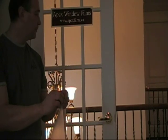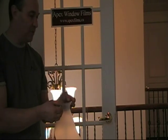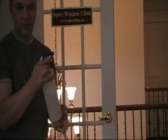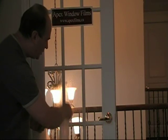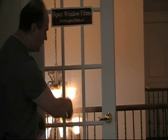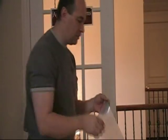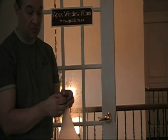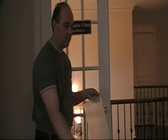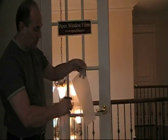In a previous video we showed you how to clean the window, so I hope you already watched that — it's a kind of an important issue. Once the window's clean, we've got our soapy water solution. You're going to give it a light spray. Don't spray it too much because if there's any dirt around the edge it tends to bleed down a little bit. For frosted film it's not a big concern, but for solar film you need the window as perfect as possible. I've taken the liner off, and we're going to spray down this side as well so everything's nice and wet and soapy.